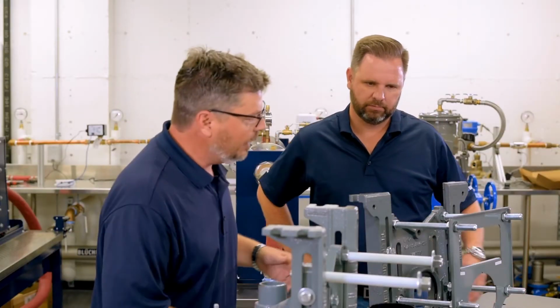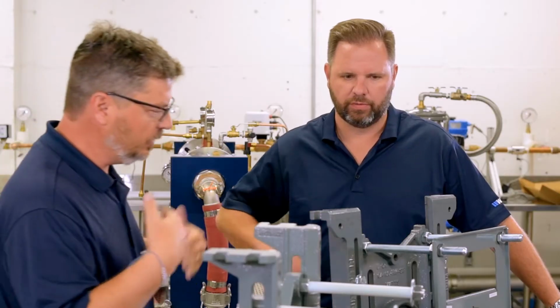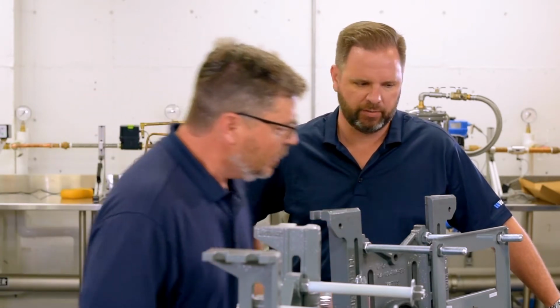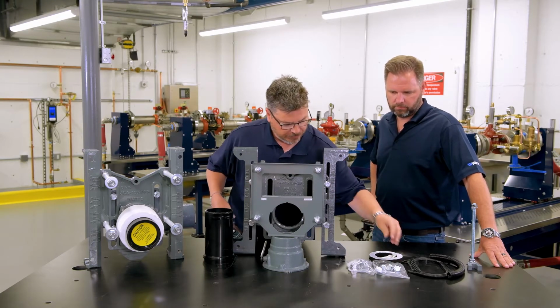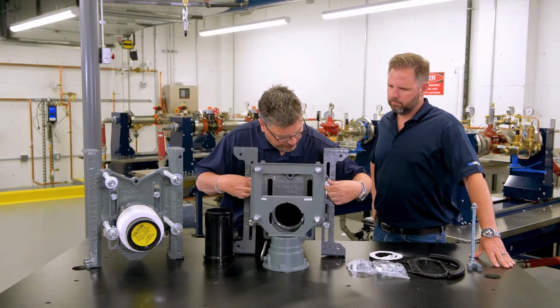Make it uniform throughout. In a prefab shop, you don't want to be changing out socket heads on different things, running from one side of the shop to the other to get more hardware. It's just a pain in the butt. So we uniformly made all of the bolt heads the same size, from the carrier bolts that fasten the fitting on the back to the front-facing leg bolts.